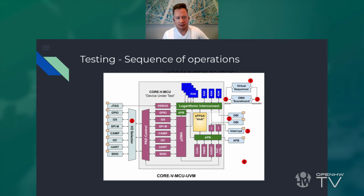And finally, this is not pictured, in the shutdown phase, the destroy virtual sequence is going to go ahead and delete any data structures in memory, and it's going to read back any null statistics from the micro DMA for analysis further on. And there you have it: end-to-end testing of the MCU using the micro DMA engine and the peripherals.